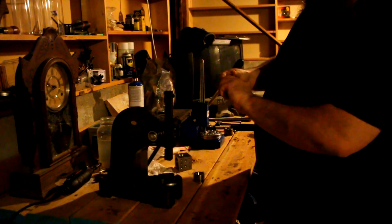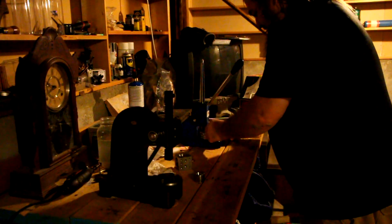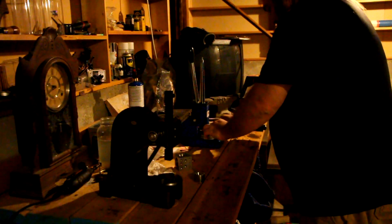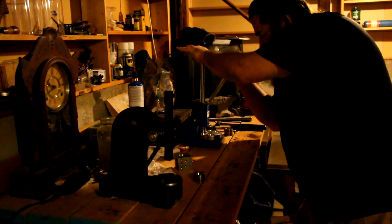Now, normally, after the punching process, it leaves some burrs on the inside, but this is a really clean punch. I'm feeling along the edge of that. There is nothing sharp. Nothing that feels like it's going to cut. I got one small little flare up. I'm going to see if I can handle right here. I'm not going to apply much pressure. There's just this little lip that was the part of the outside of the coin. I just want to get rid of that lip just so the ring has a really nice professional finish to it. Oh yeah, that's perfect.